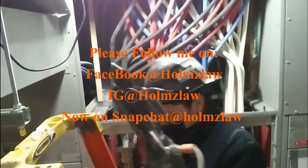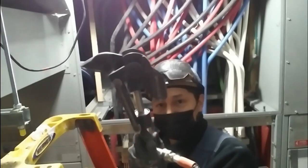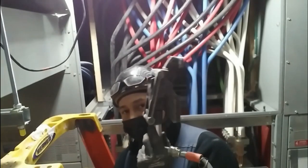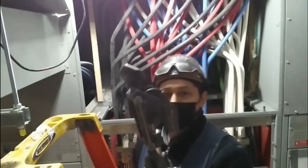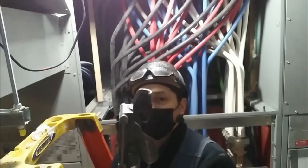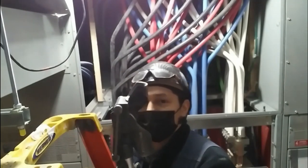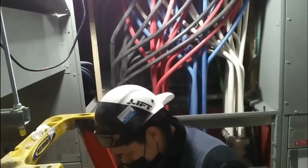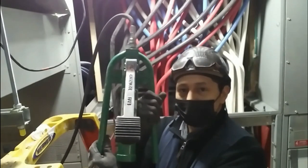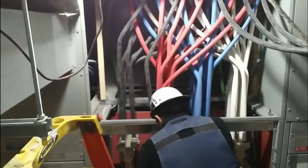So we're starting off with the wire bender — a lot of people wanted to see the actual wire bender in action up close, so here you go for those that requested it. Now there are a few pointers I didn't touch upon last time that I want to cover. It's not going to be that long, just a few minutes. When we're terminating these wires, as you see in the back, they're all terminated in order: black, red, blue, and neutral.